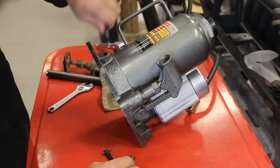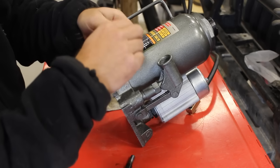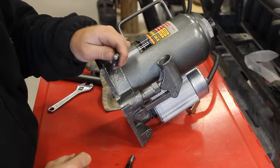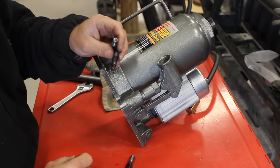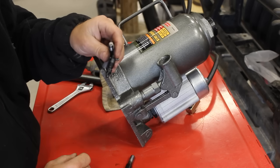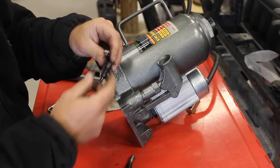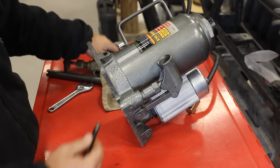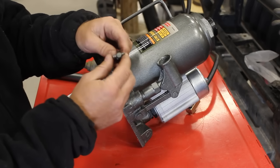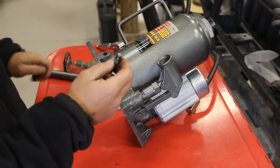And then all I would have to do is drill a hole down in here and then create a plunger of roughly the same diameter, same length, and press it down in there. I can do all that on my lathe. Problem is, you guys don't have a lathe. Well, it's more than likely you don't have a lathe. And that is a lot of work. I think rather than do that, I would rather attack it at this end and see if I can attach some sort of a dial or something to this.